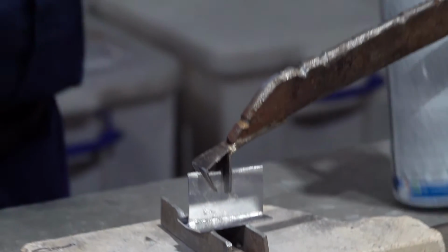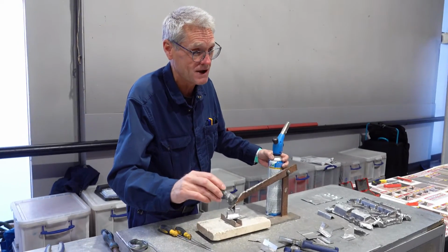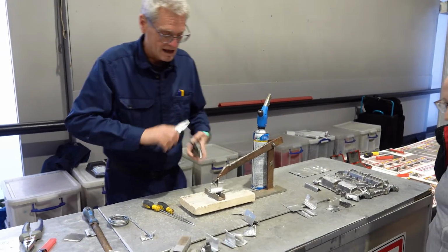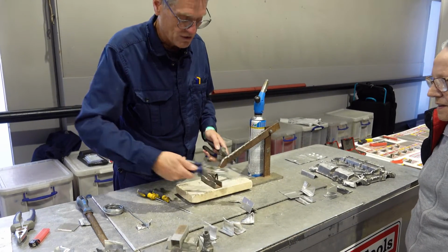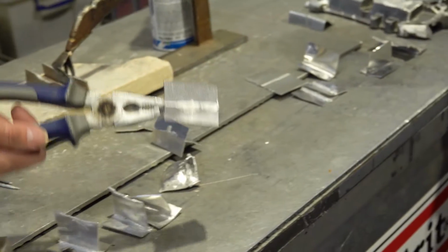And it doesn't have to be cleaned. You can even do it in dirty casting like Mazak, the monkey metal. And you will see on the back side here now, as it cools down, how the weld has trespassed without distorting the surrounding materials. Notice that. I cool it down with the water.